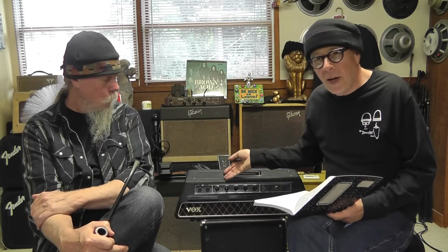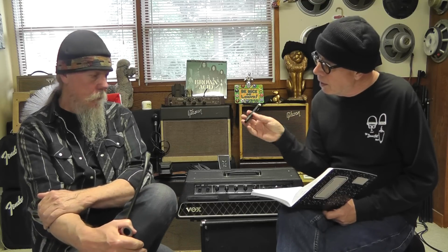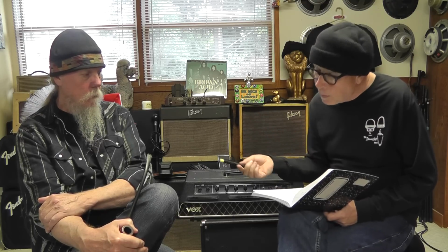We're trying to figure this out, aren't we? Yep, we really are. The only thing we know is that they sound the way that they sound, and they sound great, even though they have different tubes in them. Go figure. Don't you think another characteristic would obviously be the speaker? Oh yeah. The speakers that we're using, we like older speakers. We like Alnico speakers. We like greenbacks. Because we've compared them with newer speakers, we think they sound sweeter.